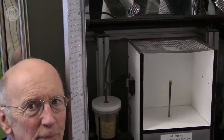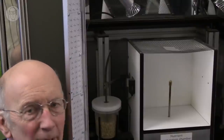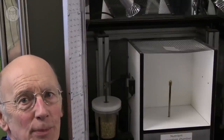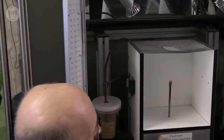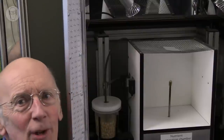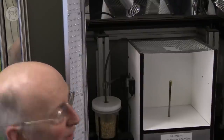I doubled the strength of the pump. I put two pumps together. And so that made the change in pressure more noticeable. And that solved this one, the sucking it up. This one, the column, was still unreliable, I think because burnt bits of corn sometimes got stuck down the tube.